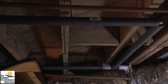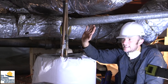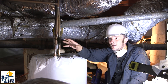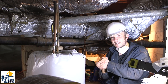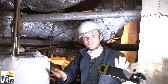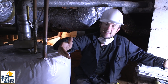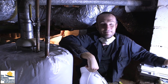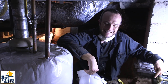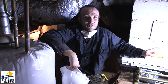We found a ton of air leakage coming in here. So we want to insulate at the walls, which is the right place to do it. First thing we're going to do is block off these vents to outside — that will take care of a lot of the air leakage. Then we're going to use 475 High Performance Building Supply products. We're going to drape the walls with an airtight, vapor-open membrane called DA. The DA membrane being vapor-open is very important. When you have plastic on the floor of a crawlspace, that's good, because dirt is wet and it's going to be evaporating up into the crawlspace.